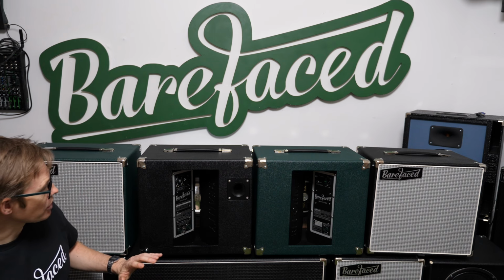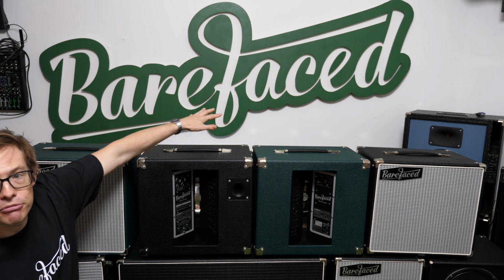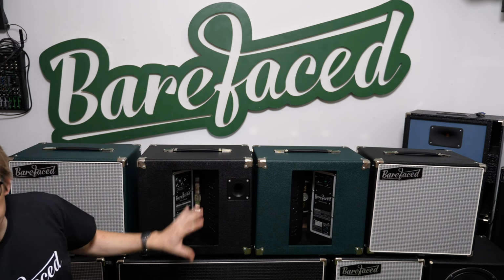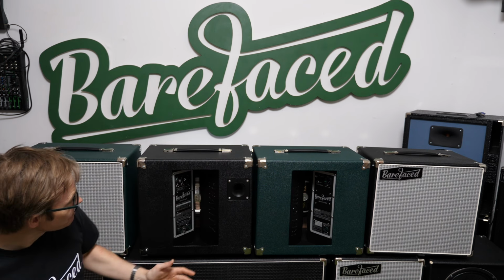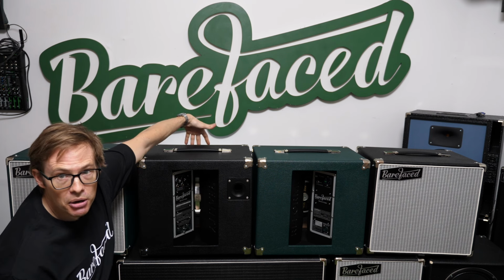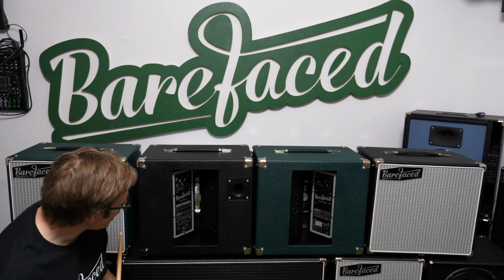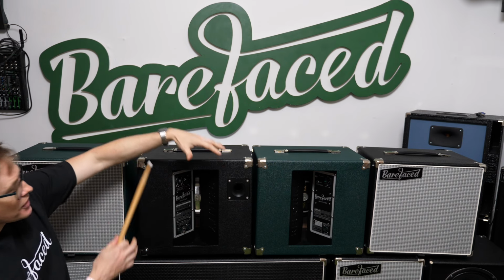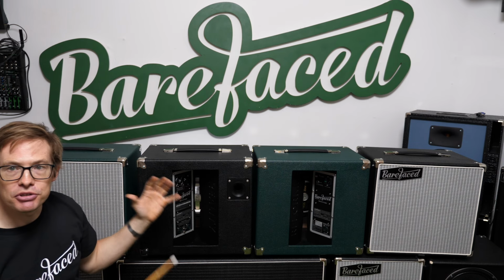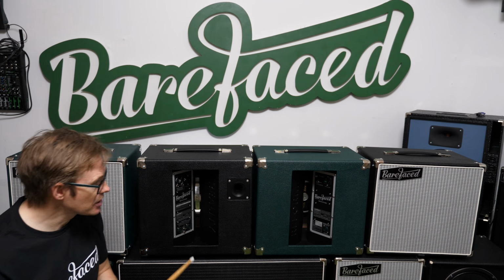And then we're going to give you two different ways of using the Activier module. One is with one of our FRFR cabs, so full range, flat response. So this is the reality here. You'll see that looks different. It's got a rear firing tweeter. You've then got a coax woofer that's firing forwards with a coax tweeter, so that's firing that way. This is the front of one of these here. And that gives you accurate response, so you can use your speaker and cab simulations.